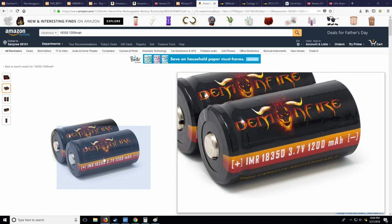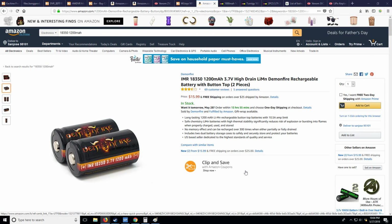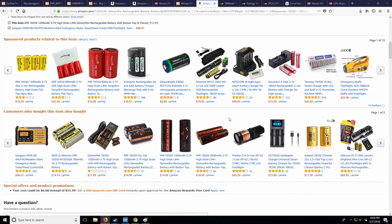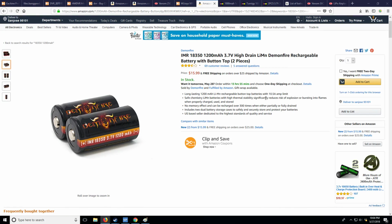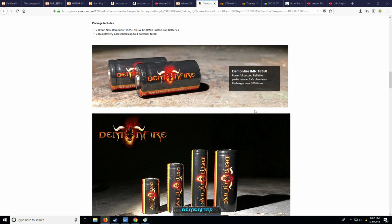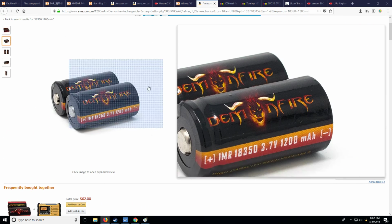I will look at some more batteries, but right now it's got a slight density lead on the LiPo. 1200 divided by 1000 is a 20% increase in density for the same weight. Also, this guy will drop lower in the voltage curve before it peters off, and it's going to be easier to store on the final version because it's tighter. I can store it further back.